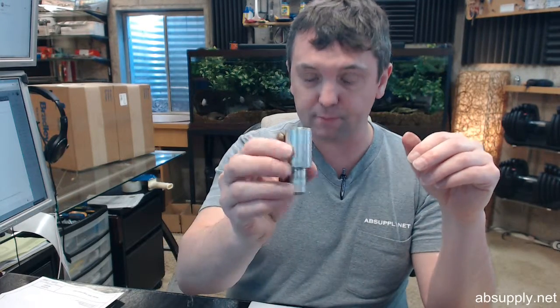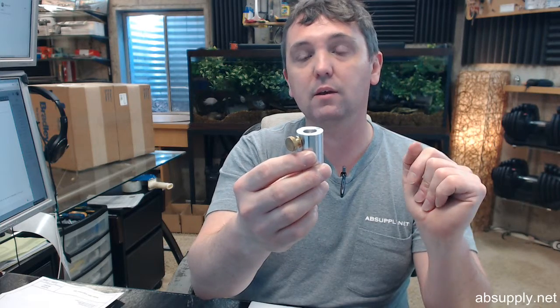Now, maybe before you do that, you're going to run your plumb bob line through this hole, and you're going to have it exit out through the side hole. Plumb bob string will come out, the bob will be connected down to the bottom. This thumb screw is for just keeping that string right where you want it to be. Okay. Now, admittedly, when you tighten that thumb screw down, your string is not going to be in the exact center, depending on the size of your string, but it will be so close that it's considered accurate. Okay, and that's the entire assembly for a center hung.